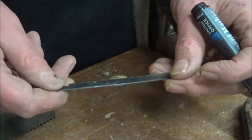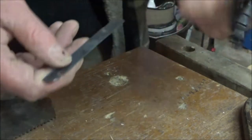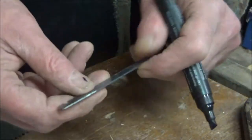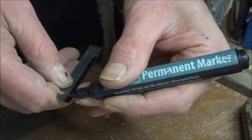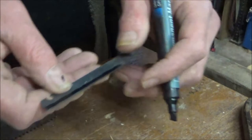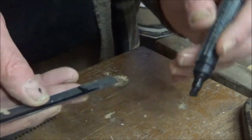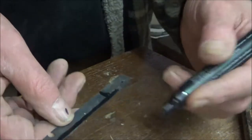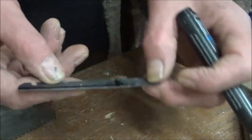This is now cool enough to handle. I'm left-handed so I'll use it like this. I don't want to put an edge on this side — I'm not too worried about that, I'll cut that off. The edge I've got to file is this underside edge. I've seen some of these that are actually curved this way, so I might try that. I'll leave that for the handle a bit — I might have gone a bit short. I've got to drill two holes to peen it because it's soft now. I'll do the holes first.